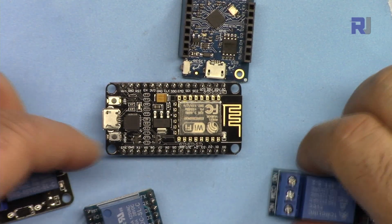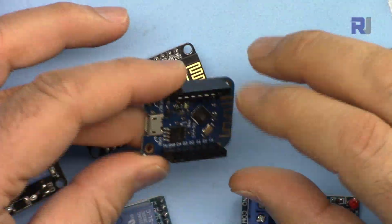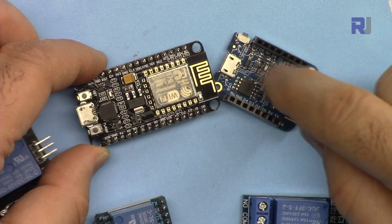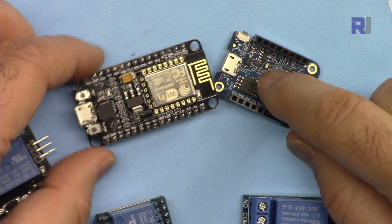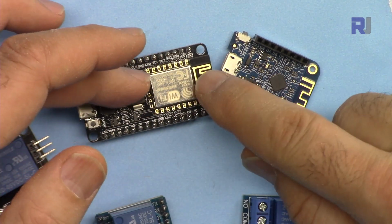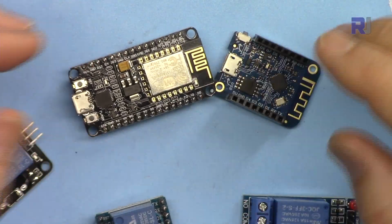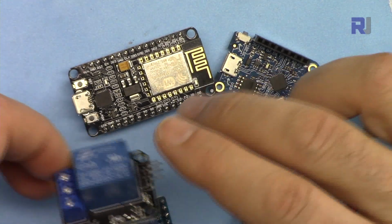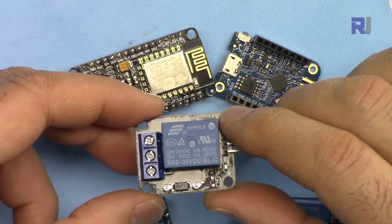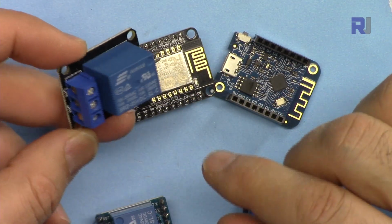And selecting type of relay for the NodeMCU ESP8266 and also the D1 Mini ESP8266 for both cases, because these modules both operate with 3.3 volts. USB gets 5 volts, but internal circuitry and the GPIO, the pins, are based on 3.3 volts logic. Majority of the relays that are available are 5 volts, but there are 3.3 volts relay available, not as much as this 5 volts that are, because they are popular with Arduino.